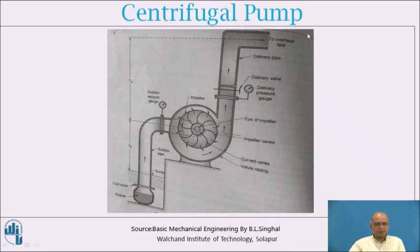Looking at the construction of the pump, the casing is the outer part, and inside it the impeller — the rotary part — is located within the housing of the centrifugal pump, supported by bearings at the ends. The suction pipe is connected to the casing at the central location, which is called the eye of the impeller.